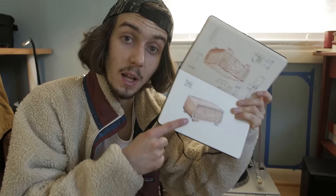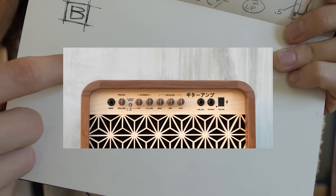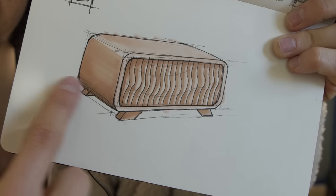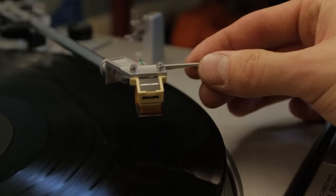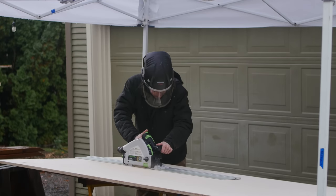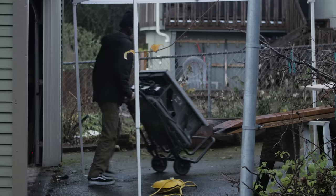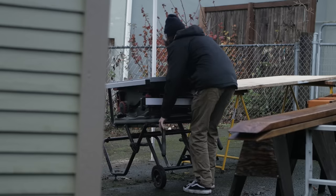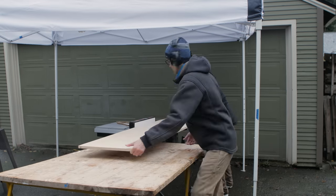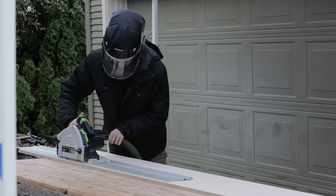After quite a bit of sketching, this is the design I've landed on. I want this cabinet to have curved corners so it matches my guitar amp, and the front is going to have this cool naturally carved contour — this will make more sense once we get started. The first thing I had to do was cut out this eight-foot-long piece of Baltic birch plywood, which I would later bend to create the cabinet itself. With the help of my dad we ran it through the table saw, but I quickly realized it would just be easier to use the track saw to remove the remaining material.